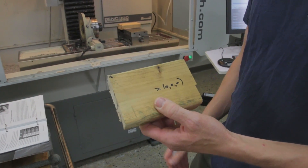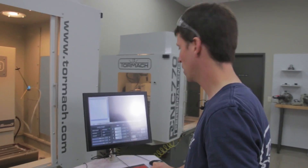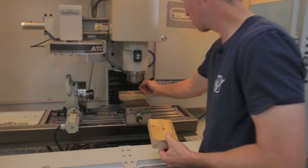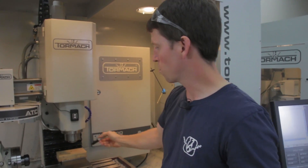Or a lot of times the back left corner is used. Often, if I have a workpiece that's already had some work done on it — maybe I'm flipping it over to machine the other side — I might use a feature of the workpiece like a hole or a circular boss that's easy to touch off to or swing in with a dial test indicator as the workpiece zero. For this tutorial, we're going to be using the center of the workpiece. That relationship between machine coordinates and workpiece coordinates is known as work offsets. For more information on that, have a look at the video on work offsets.